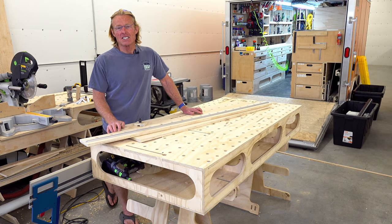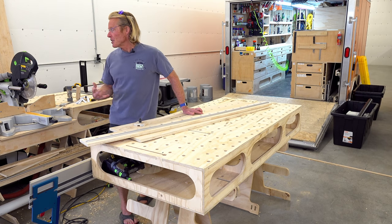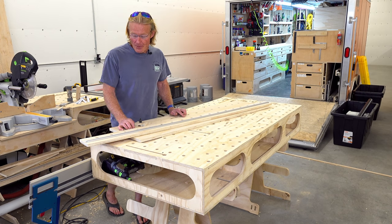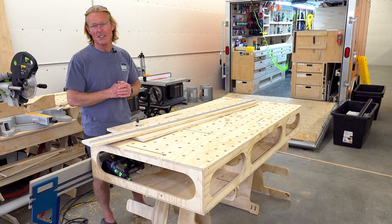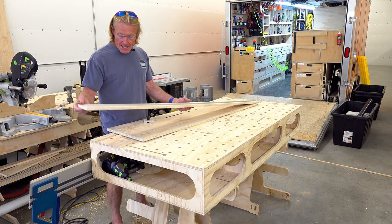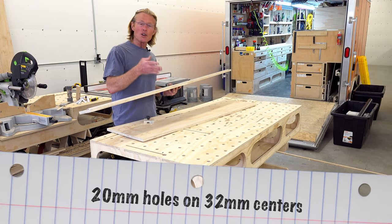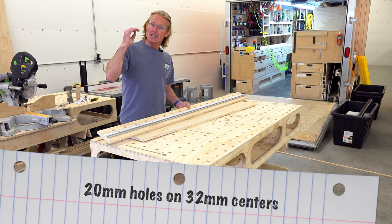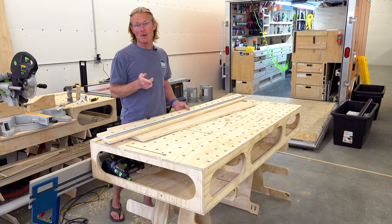Now I already have a great crosscut jig that I've used for years, but I wanted to update it to work with my newer benches — my smaller benches as well as my larger benches built with the 32 millimeter system. So what I've done is create basically a three-part jig that I don't have to ever calibrate. Maybe one part I'll have to calibrate, but I'll show you that in a minute. It uses the 32 millimeter holes on my benches, which are cut with the PARF guide — absolutely computer perfect. I know I can trust them for being square, and that's all I need for my crosscut jig.